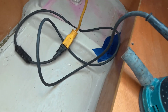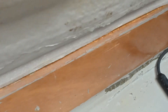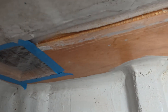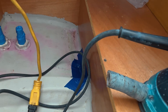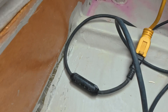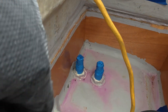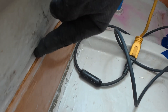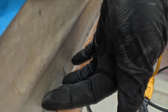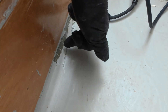We're going to do this whole joint, from one side all the way to the other side. We rough up the wood with the 80 grit. Then I have a grinder with a 24 or 36 grit to remove all the gel coat, the paint, and the gel coat on the bottom where we're going to be applying epoxy — laminating all the way from about here going up to here. All gel coat or paint has to be removed. I'm also removing the Plexus, the original glue — I'd rather put epoxy paste here than have the original glue.